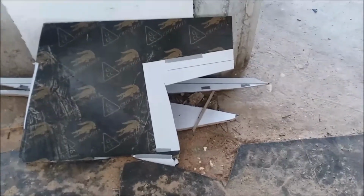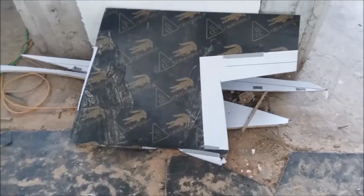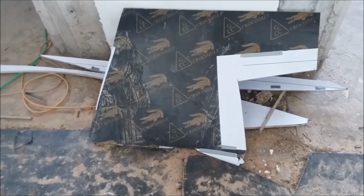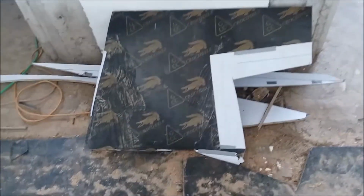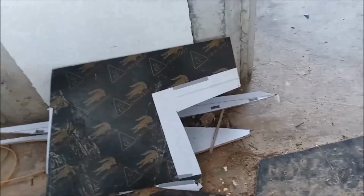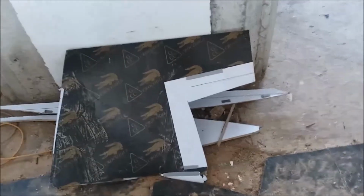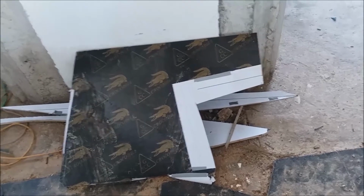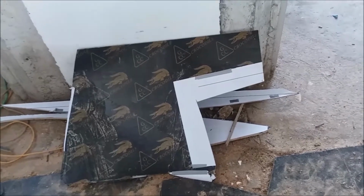Anyway, you tape down one end. It could be either end, except that this one had all uneven tails on it. So we tape down the tails. And then you go to the other end and you get a piece of PVC pipe. In my composite shop back in the States, I used 2-inch pipe for patterns, but what we had here was 3/4. So we used 3/4. You roll your pattern up past the center line of the sheet. We went about 60 inches or so out of 96, and throw a weight on it. And you want to roll that up fairly tight onto the pipe. Don't get it all bunched in heaps, flopping around on one end.